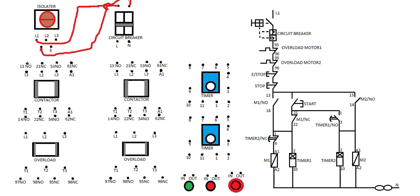To show that you wire it through the neutral, and then from your live you're going to the overload. This one we can say it's motor one — this is a contact representing motor one. This is motor two. So you wire to motor one at terminal 95, and then from 95 to output. We're going to do only the control circuit here.